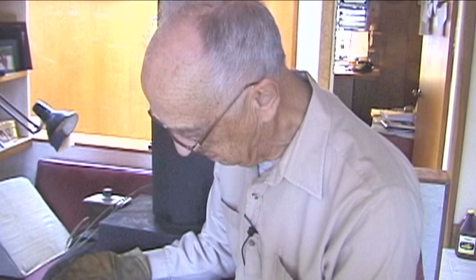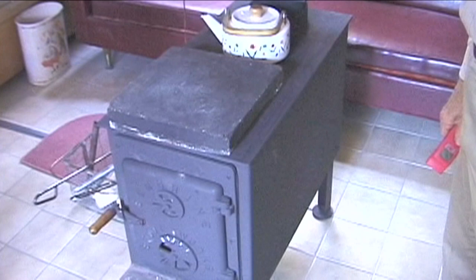So all these little refractory things. Let's just make a point here. One of the things that you quantified back in the 70s related to wood stoves. There are three criteria for making a wood stove work properly. The first one is to have adequate temperatures: high temperatures, a lot of turbulence if you're mixing, and also a place where things incandesce, so anything that's unburned can impact on that.